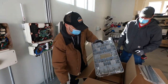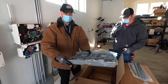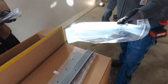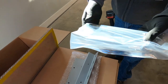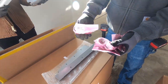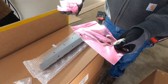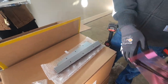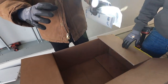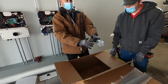Here's the base — it's not a wall mount. The batteries sit on the floor, so the two battery packs will sit on this base. Also, some long bolts will secure the battery control unit to the top of the battery. You'll get some different grommets for bringing the wiring into the top of the control unit, and then some little zip ties to secure the wiring inside the control unit. These two plates fasten to the bottom on the side of the two packs in order to connect them to the base plate and connect them together.